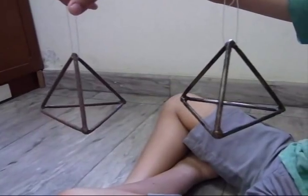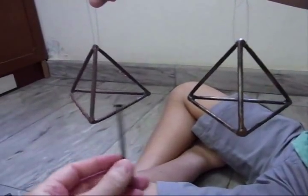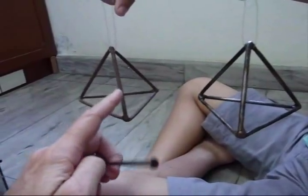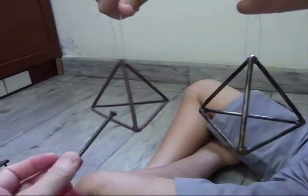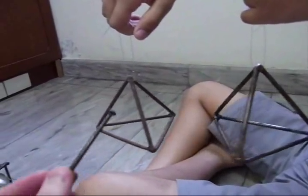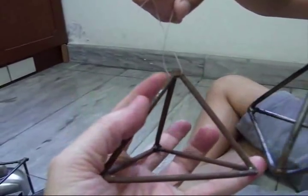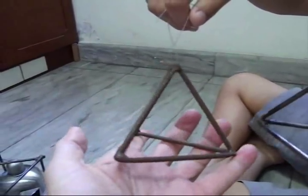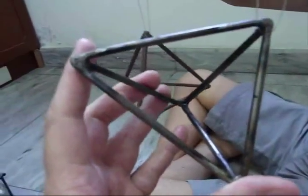These are two triangles I made. I was trying to make musical triangles, ones that would be different pitch on each. As you can hear, this one is a lot more melodic than the other one, I guess you'd call it. This one sounds kind of dead when you hit it, and the difference is, I struck this one with a hammer on the corners to stress the metal so it rings nicer, and this one was not. It was just welded together.